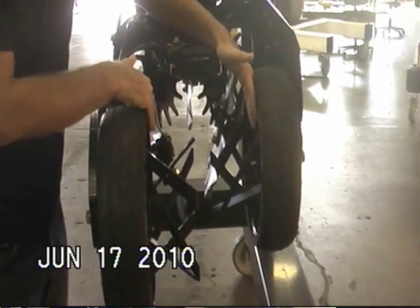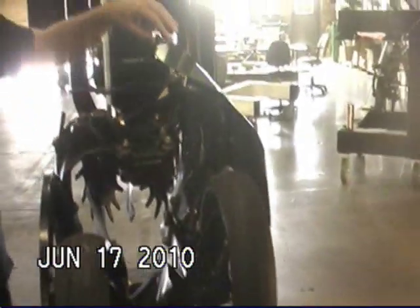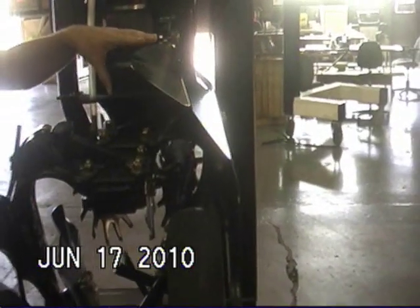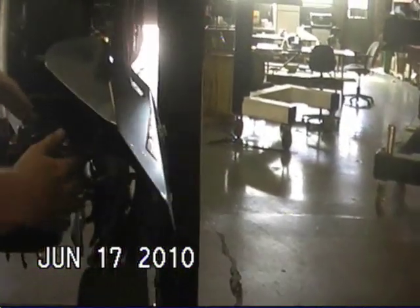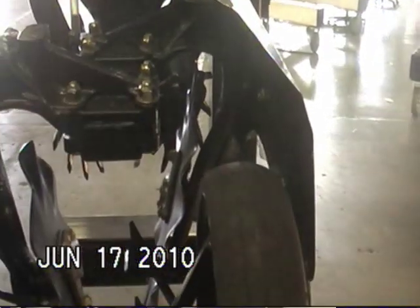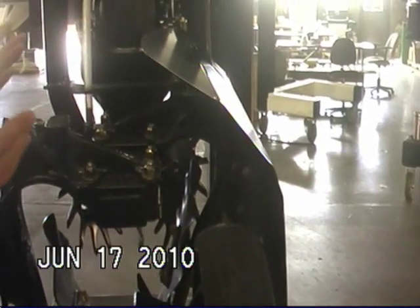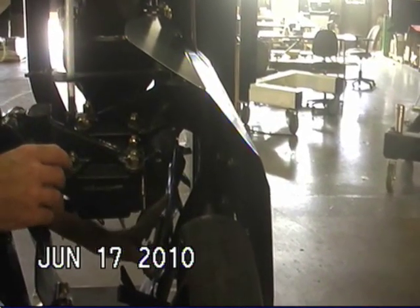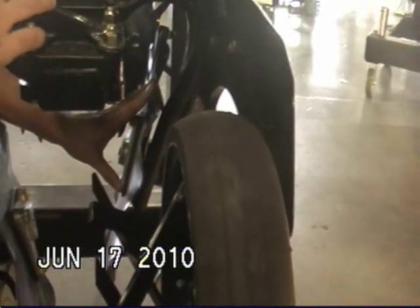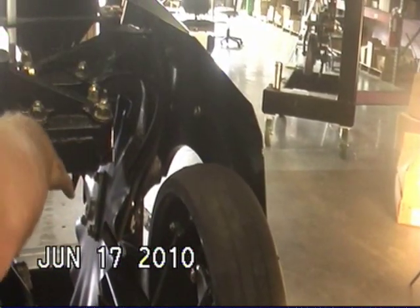The soil which was originally in the strip, we want to keep it in the strip. This is also the purpose of the mudguard — a steel sheet metal formed piece positioned to catch any soil being thrown off of the larger diameter blade. People frequently ask why there isn't a mudguard on both sides, and the reason is it hasn't proven necessary. The middle blade is larger and runs slightly deeper, and in some soil types in extremely wet conditions you'll get a tail of soil which the mudguard deflects back in.